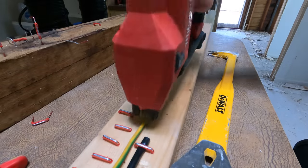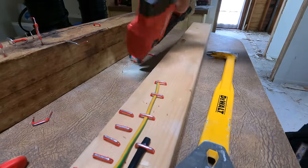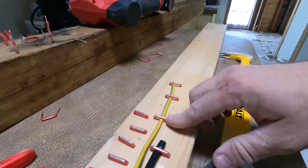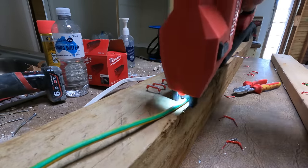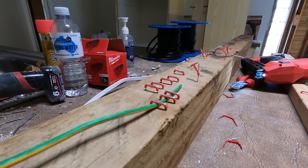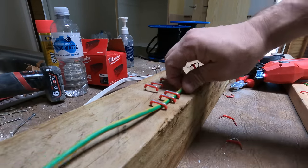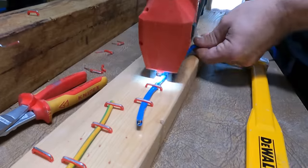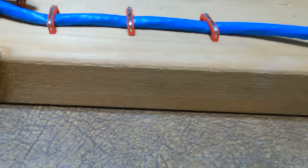Let's go a bit of six mil earth - yeah that's brilliant. It's actually a little bit tight but I don't think it's doing too much damage to the cable. Into hardwood it's a little bit loose but gets a little bit tighter. Got a bit of Cat6 cable - let's go one. For me that's a no-go, especially coming from commercial work. We have to get all our data certified - it's not to be under any fixing like that. You need velcro, no clips, and definitely no cable ties. But I know plenty of guys are doing it and Milwaukee even says on their page it's good for Cat6 cable.